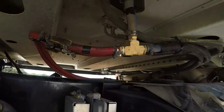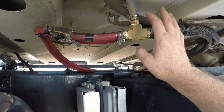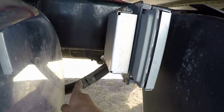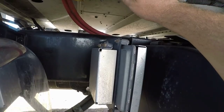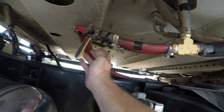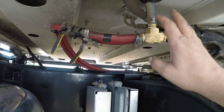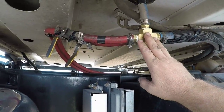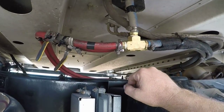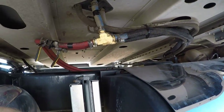And then what I ended up doing was I tied into the coolant lines of the truck, and this is similar to how it was tied into on the old truck. So the 1-inch coolant lines come up on the back, and then it's converted into I think it's 5/8 coolant lines, because that's what the factory size is right here. And then we got the valves here, so I can turn these valves off right there, and then that'll isolate the generator from the rest of the truck. I used all metal connectors, so I won't have an issue. I did have an issue years ago on the old truck. I used a plastic connector and it melted, so I used all brass fittings on this one, so should not have an issue. So that is the coolant lines for the truck.